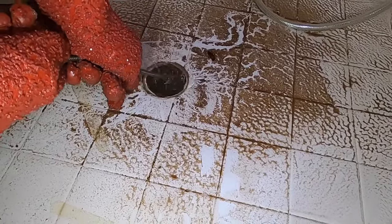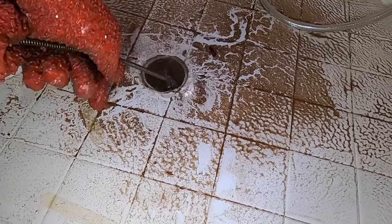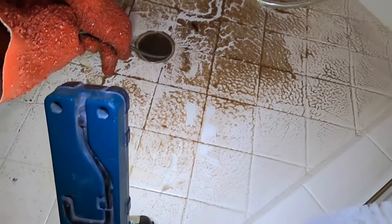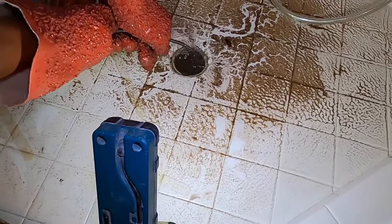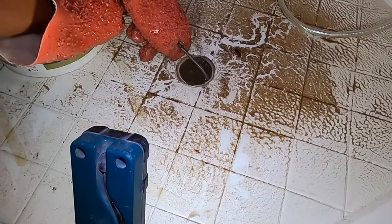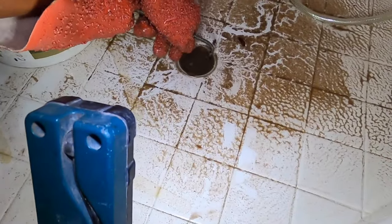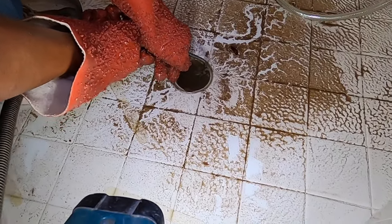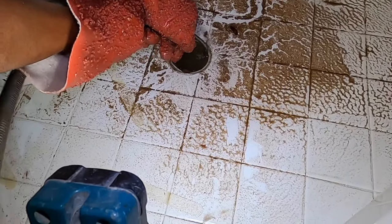When the water goes down, you can determine how far down the drain the cloggage was. By the way, those gloves we're using are called ugly gloves, and ugly gloves are a necessity any time you're snaking out a drain. If you use regular cloth or leather gloves, the snake machine cable will grab them and wrap around — and it's really painful.